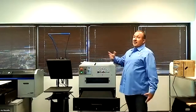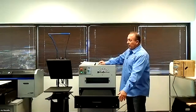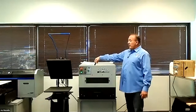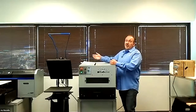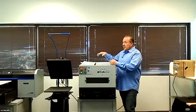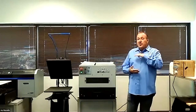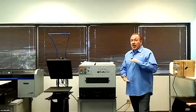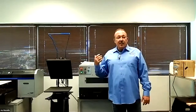Everything's enclosed so you don't have all this vapor spraying around. Keep in mind when setting your distance: there is a time lapse between when the pump kicks on and the solution actually spurts out of the nozzle. So you always want to go about an inch to an inch and a half further than you actually want to pre-treat on the shirt, because the head is traveling and you want to make sure you have ample pre-treat. The worst thing is starting to print a shirt and the last quarter inch of that design is not pre-treated properly.